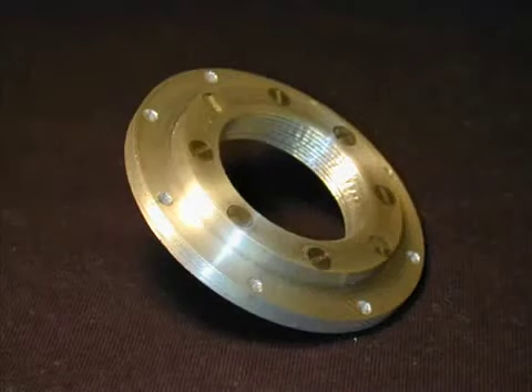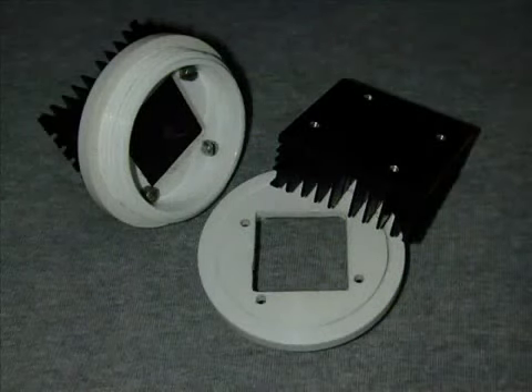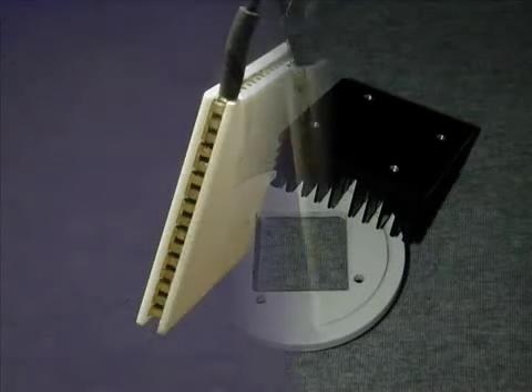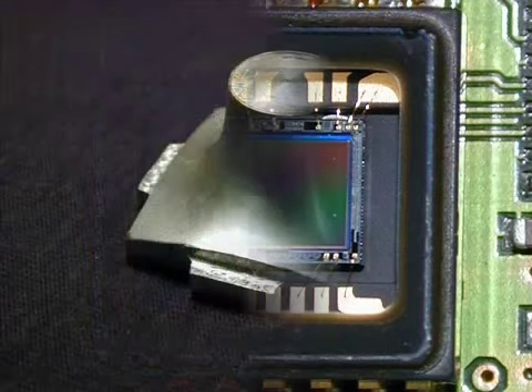You need a part to connect the camera to the telescope — this one's aluminum. Here you see the cutout for the Peltier chip in the heat sink. These chips are actually refrigerators: one side gets hot, the other gets cold. The imaging chip heats up when it works, so you have to cool it to keep from ruining the picture.